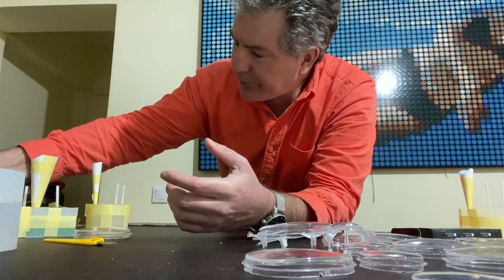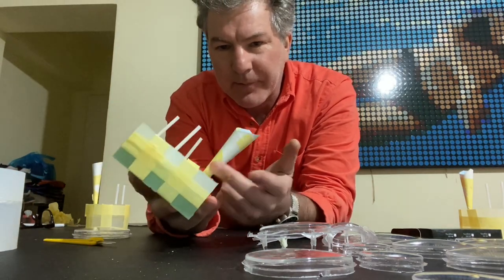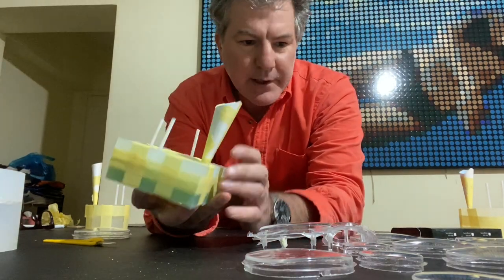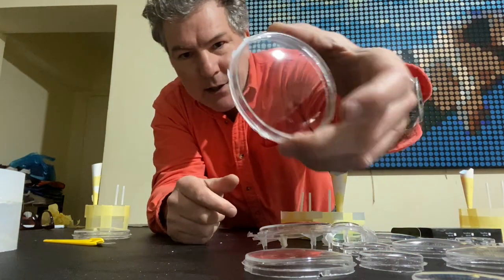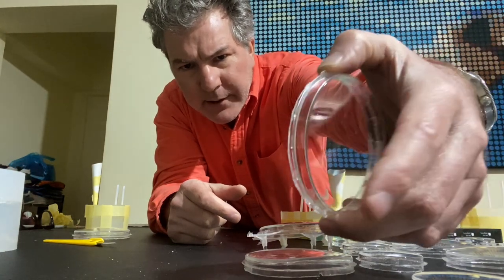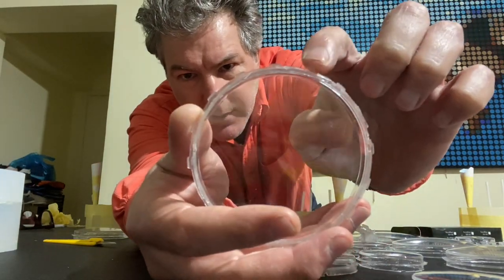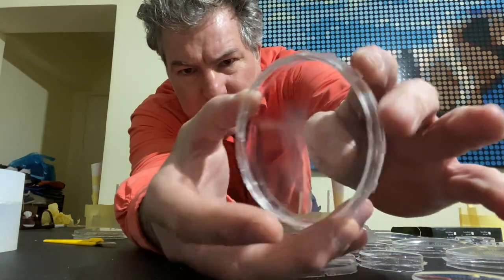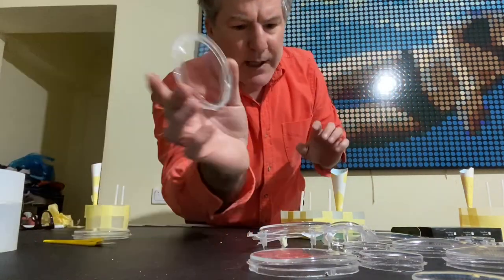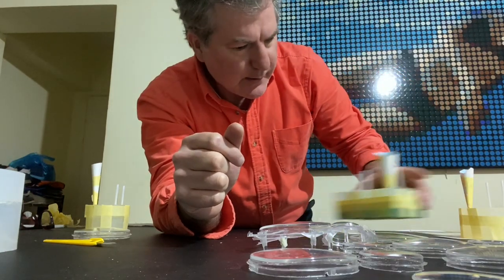I got the best results from doing it like an injection mold with fill ports and vent ports. This is how I achieve this kind of quality — it's super quality with these very thin tabs, about half a millimeter. The result is amazing.